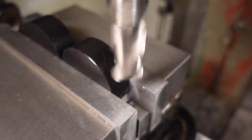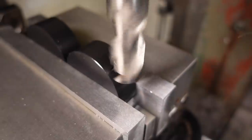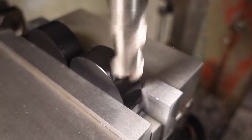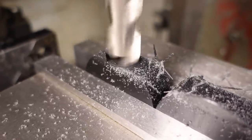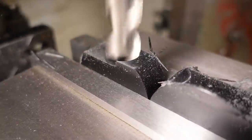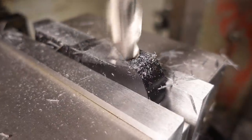One of my viewers chided me about saying Delrin was invisible to RF. As a test, I put a block of the stuff in between the second and third directors of my 70cm Yagi and blasted it for 10 minutes at 400 watts. The block actually cooled down, so the 0.02 loss tangent isn't much of an issue when it's small compared with the wavelength. Also, there was no change in the resonance or match of the antenna.